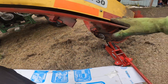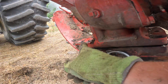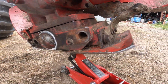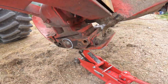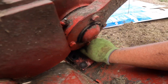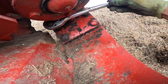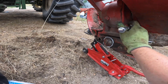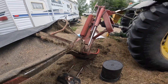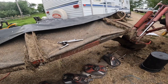Basically, I put the module — I leveled out the gearbox, put a jack under there, got a bolt in there, and I'm jacking this up. It looks like it's going to match up fairly decent. I put all six bolts in, made sure they were all good — finger tight, not cross-threaded — then tightened them up to hold the drive module to the gearbox once I knew the gear was lined up appropriately. Got the bottom module bolted on, checked it — it's spinning nice and free. Now we've got to slide the cutter bar back in.